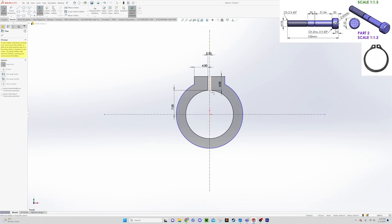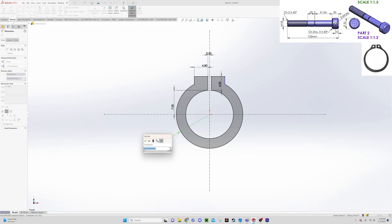Using smart dimensions, we can see the inner circle is already defined by the corner positions. The outer circle needs to be defined — right now its radius is 9.8mm. We want the ring to stick out from the groove at least a little bit. Our bolt is an M18, so if we make the ring radius 10mm, it will have an outside diameter of 20mm, giving at least 1mm of surface sticking out from the side. Let's set this to 10.